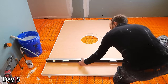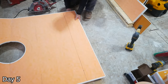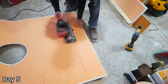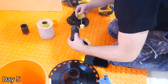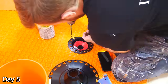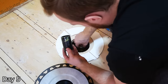Taking a 72 by 48 inch shower pan here, and I'm just going to cut down both ends to get it to the size that we need. Mark it with a straight edge and then just cut it with a skill saw — it's foam so it gets really easy, you could even use a knife. This is the island tub drain, which we're just going to glue into the trap below and then screw it down into the subfloor to secure it. A very similar concept for the shower drain — we're just going to glue it into the trap below and then it's actually going to be thinset into place.